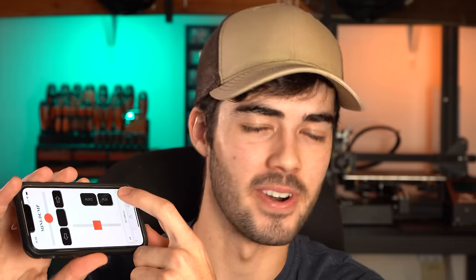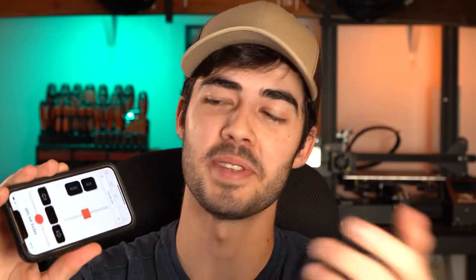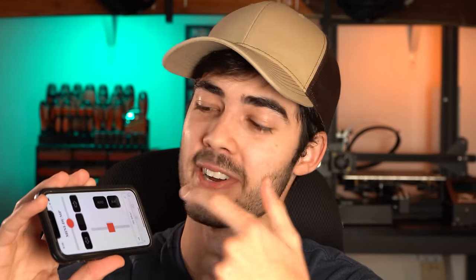As you can see, there's a lot of light coming through the white PLA around the LED — I personally think this looks kind of cool in the dark, but if you want to get rid of it, wrapping the light assembly with a little bit of aluminum foil should do the trick. On the controller side, compared to the 1.0 version, I added an additional auxiliary button — aux one is the headlights, and aux two can be bound to whatever you like. So if you want to put a horn on the Mini Dump Truck, or add a servo to run a plow, that's totally up to you. You can add more buttons — everything's open source, that's the beauty of these projects.